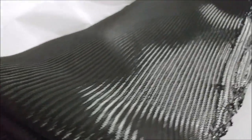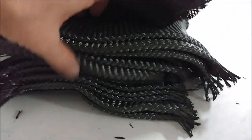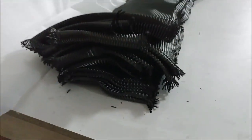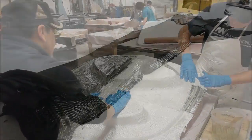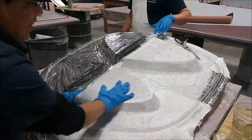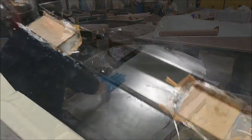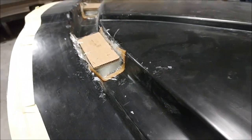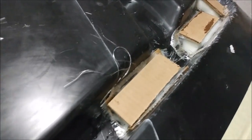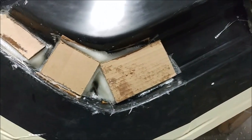Today I cut all this carbon fiber for laying up the door frame — about 30 pieces — because we're doing about four layers altogether: three layers of heavy and one layer of light, all the way around the frame and across where the armrest is. That's all ready to lay up, hopefully tomorrow. Roberto and Chris are laying up the heavy glass on this mould, which is the backing and front ribs on the strake and the tank. Those blocks are laid in place and will be popped out and cleaned off, giving us the pressure intensifiers for when we lay up the door, hopefully tomorrow or the next day.